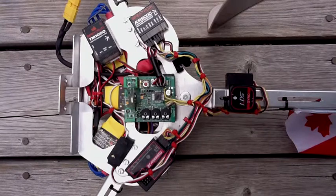There are two other modes. The ones I want to show you here are, firstly you have to arm it, then you hold your elevator aileron stick, your right stick for most of us, up at the top right, and you'll see the armed light flash twice. That is kind of the busy mode. In other words, the first arming position is a basic flight mode, normal flight. The way I armed it with two flashes is much busier, much more aggressive flying.